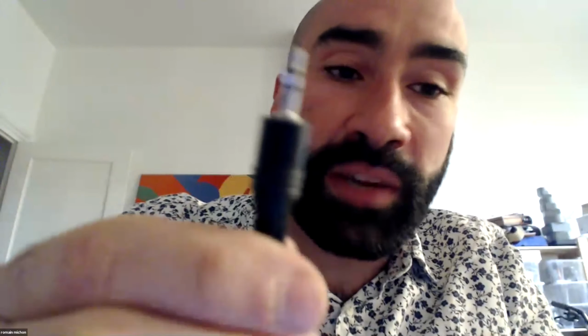I had a quick logistical question about the lab. I noticed in the lab you use a coaxial cable, but the cables provided to us actually have 3 conductors: a red, a white, and the shield. So I was wondering how we should plan to solder that to the piezo. Oh, because they are stereo cables. Yeah, I think they're actually stereo cables. Your cables are actually 1/4 inch. Oh, okay. Well, there we go. Thank you.